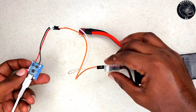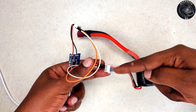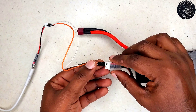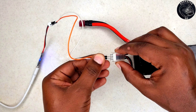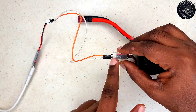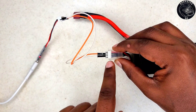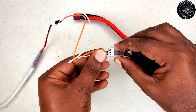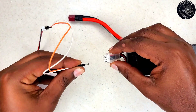When preparing to store the battery after balancing, it's crucial to ensure that each cell has the same voltage level, specifically 3.85 volts. When it's time to charge the next cell, you'll need to follow a specific procedure: begin by disconnecting the negative wire from the cell currently being charged, then take the positive wire and connect it to the port where the negative wire was, and relocate the negative wire to the next immediate port to ensure proper connectivity for the next charging cycle. It's crucial to note that this charger is designed exclusively for 1S batteries and cannot handle 2S or higher battery configurations.